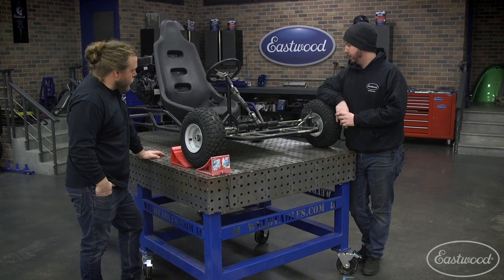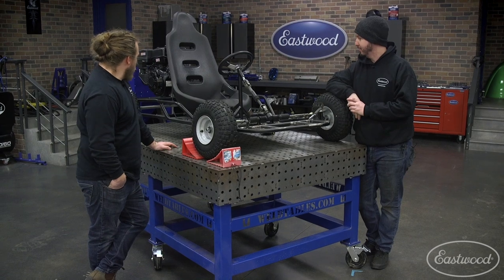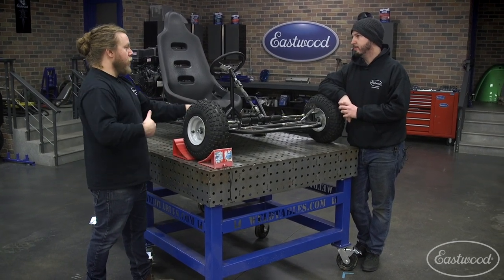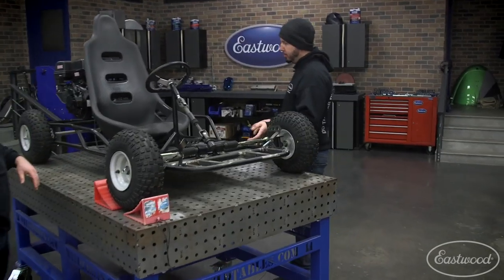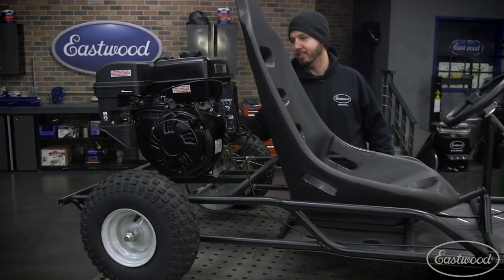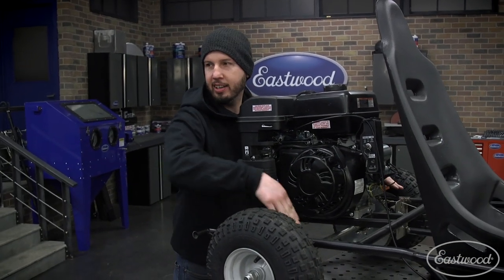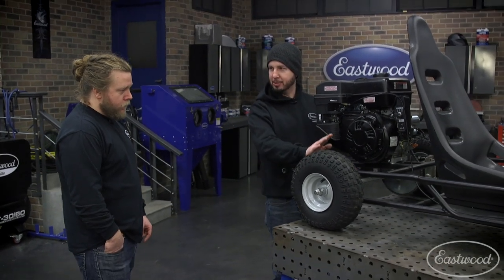It's pretty cool. I'm kind of curious where you guys came up with some of your stuff — did you draw it up by hand? We pretty much referenced some photos online, stole little bits and pieces from each one that we thought looked cool or was in our wheelhouse, and really just started making one piece at a time. Started with side rails, then cross bracing, then a nose — it just fell into place from there. The first thing I noticed coming in was your side rail is a little overbent on the top bend here. Because of that, the motor is tilted back. It's not really a big deal since everything is rigid and fixed, but in drag racing you want to tilt everything forward so that when you hit the tire it gets a little more grip. With this being a fixed axle, it won't play as much of a role — it just looks kind of goofy that it's all tilted back. It's got that gasser look to it.